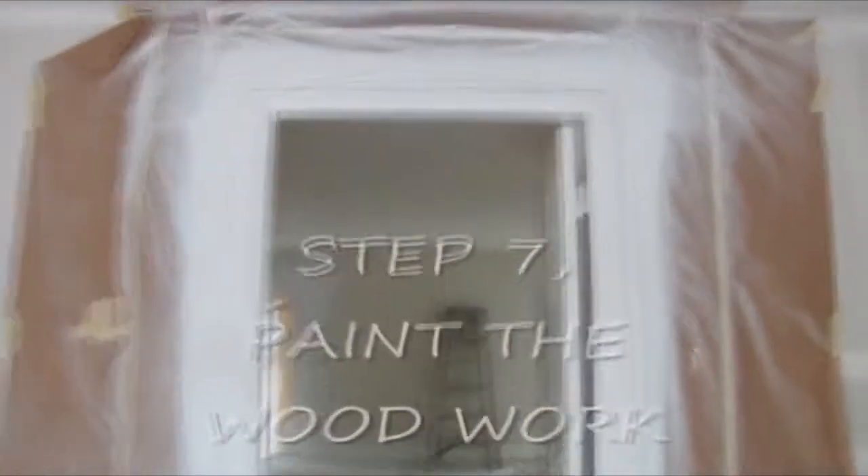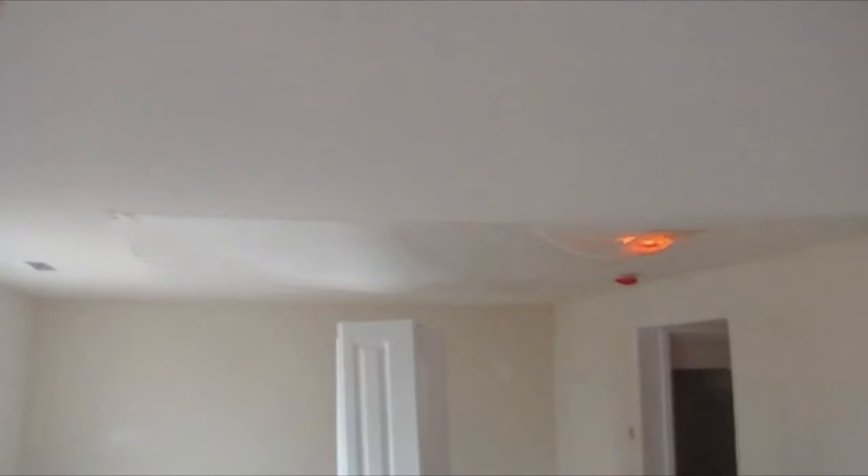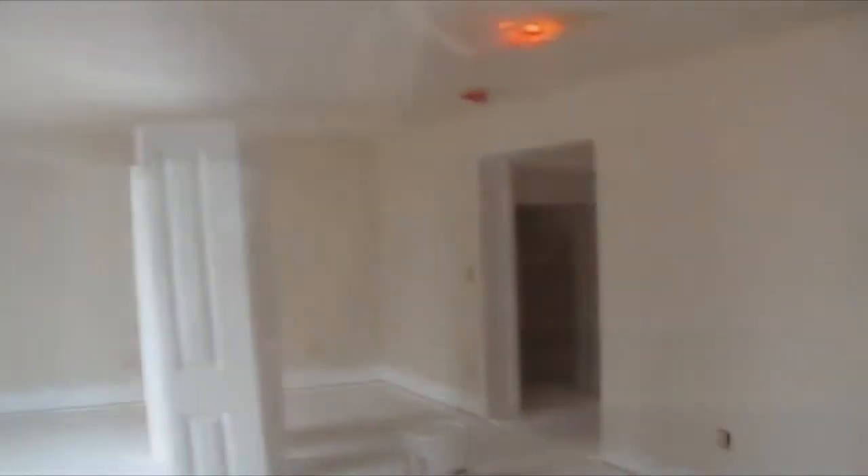This is the next phase — we've done all the painting now. We protect the garage area, but on the inside we can just spray right up on the walls. There's a heavy enough texture that we don't level it out or erase it. We stand the doors up in the middle of the room, protecting the ceiling from any overspray.